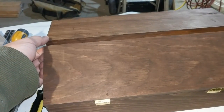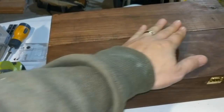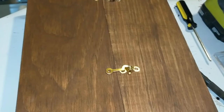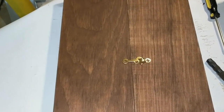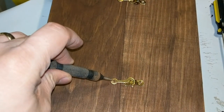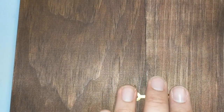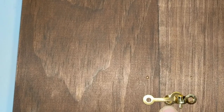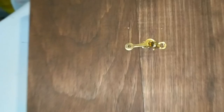Our hinges are in. I pick it up, make sure it opens and closes nice and even — nice. I put my hook and staples — these little guys — up front and eyeballed where they should be. I picked about halfway, one a little bit higher and one a little lower. I used my center punch to put a little indent right in the center of each one. Now I have my marks. I'll do the outside ones now and the inside one once I confirm everything fits, so I can always adjust that last one and screw them all in.